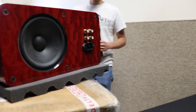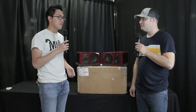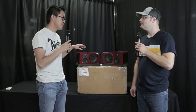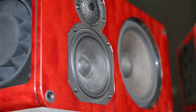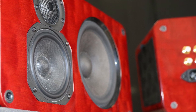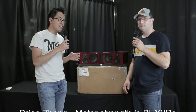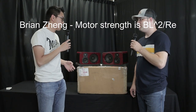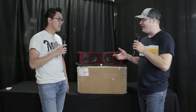On the speakers here, I started by using the best small drivers I could possibly get my hands on. For example, the tweeter is the small version of ScanSpeak's top-of-the-line beryllium tweeter — it's just small with a smaller faceplate. The midranges are also ScanSpeak's neodymium midranges. And the woofers are from WaveCore — I picked them because they had the highest motor strength out of small woofers, so you can get as much bass out of a small speaker as possible, which is super important for me.